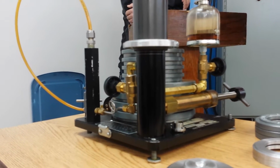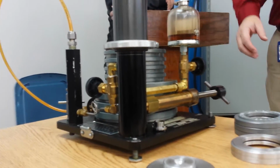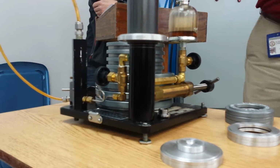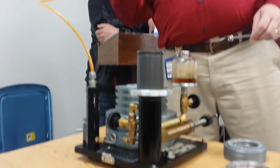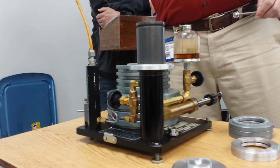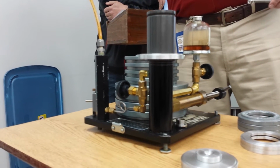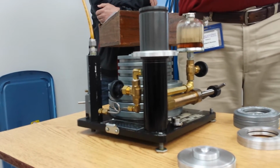If I look at that gauge and try to make that gauge hit 10 PSI, I can do that. But that's not what we're after. We want to make sure that I have 10 PSI applied to the gauge. And now the gauge says I've got 5, 6, 7, 8 PSI on it. So the gauge is wrong. Okay? That's what we're trying to find out. Is the gauge right or is it wrong? That's the charts that you build.